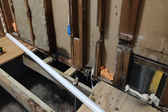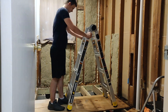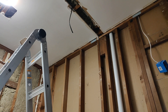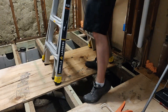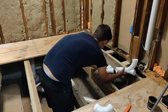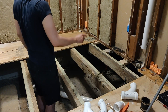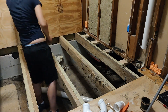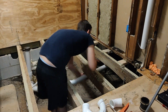It was just held up with friction and all of my working around it probably made it fall. Luckily it didn't damage the pipes it hit — I tested it, it worked out well. But now I had to replace the full vent pipe which goes through the roof. I don't have good access in the attic, so I had to use the little hole in the roof, stick the pipe up, and just caulk the crap out of it with sealant through the hole with my wife holding up the pole on the bottom. Rest assured it is gooped up there, inserted into the roof cap — a full covering roof cap — and it is sealed up. I've verified it with rains and storms and all is looking great. But it was the exact thing I was trying to avoid. Lesson learned: support the vent pipe. Those big, heavy cast iron vent pipes.